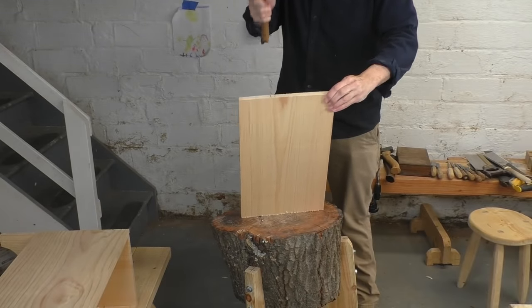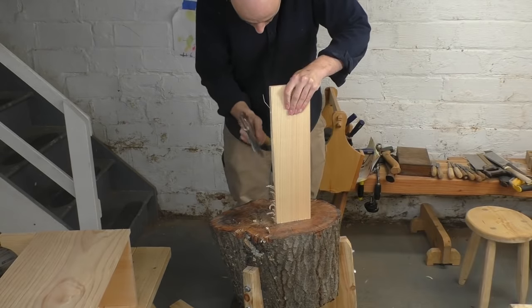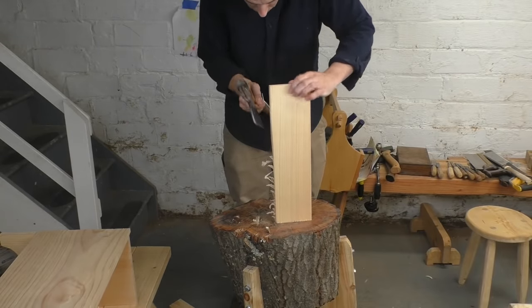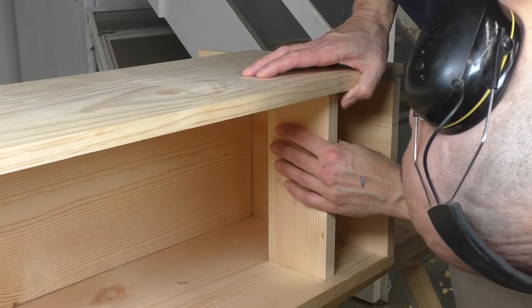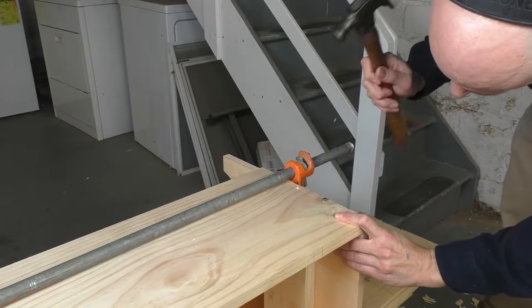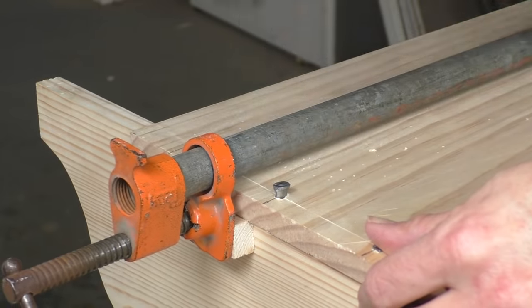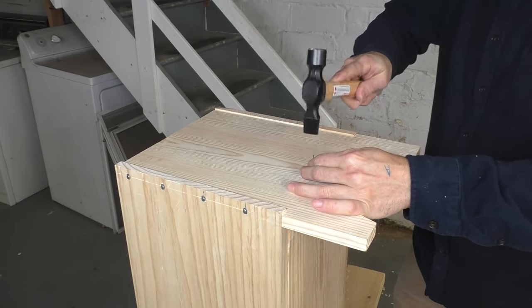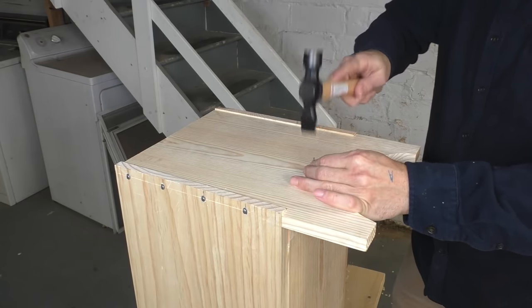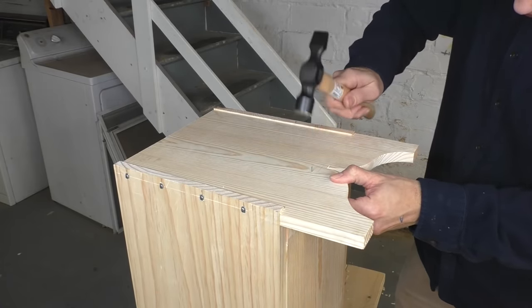Now I can make all the till parts, and there's plenty of scrap wood sitting around. For small parts in straight stock, the axe is always faster than the saw, and pretty soon I'm fitting the till and setting the top in place. At this point I'm a pro at driving these nails, and the whole piece is starting to feel tight and solid. I also drive a couple of fine finishing nails through the ends and into the bottom for extra insurance, keeping these nails near the center so the bottom has room to expand and contract with the seasons.